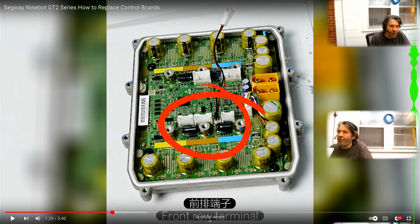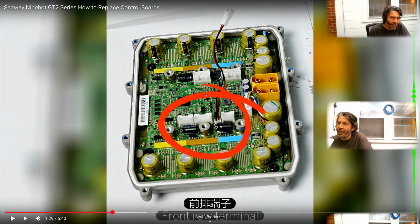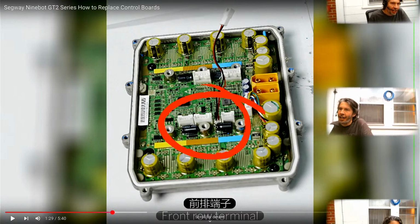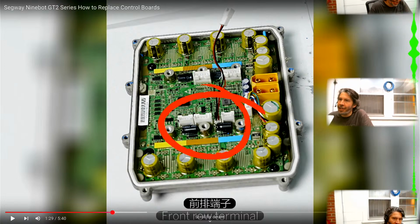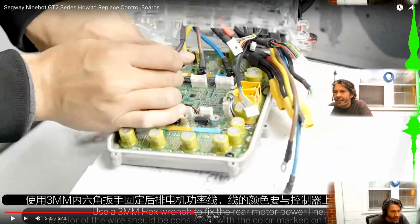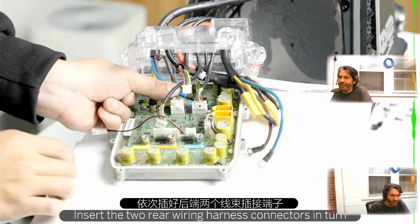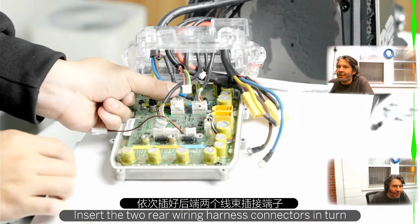But essentially, the controls look to be the same as what they're using in the more consumer scooters like the Maxes and whatnot. There are two 6-pin Hall effect sensors that go with the motors. I suspect this one is lighting, and this one down here is a 5-pin for control. So just a couple different views of that. This appears almost like an afterthought. These cables seem to run back into the board or something. I'm not sure what to make of those.